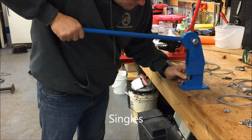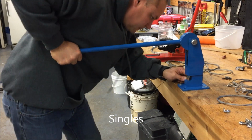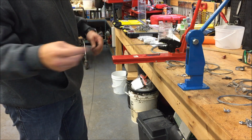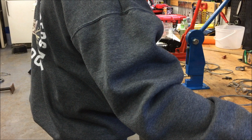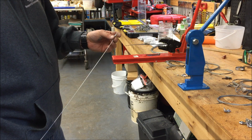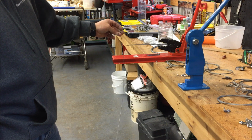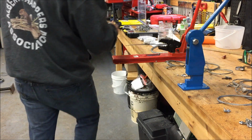So I put two double ferrules on, leaving about an eighth sticking out. And give it a good squish. And that shouldn't go out. So for here, because I flattened that out, I'll put a little washer. Just a riveting washer. You can go to a hardware store or big farm supply and say you need some backup plates for rivets, and that will work for you. So we got this here, we got one washer, just gives it a nice surface for your kill spring to go on the back side.